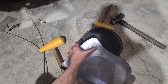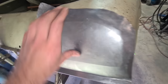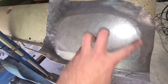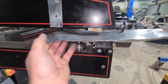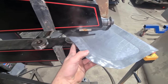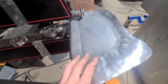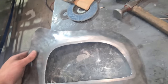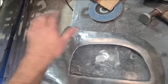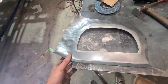Just roughing this area out with the mallet and the sandbag, then I'm going to go back to the machine to give that corner more of a shrink and just keep gradually bumping it down until it's the desired shape. The sandbag's on the ground because I was playing around with the other side of the nose cone on Sunday. Before I wrap it over too far I'll tip this flange for the tail light bucket — this is why I'm not putting too much shape into it, because if I tip that around too far it'll clash on the machine and I won't be able to do the tail light bucket. These are just the problems you encounter beforehand and then strategically avoid in the future.